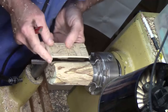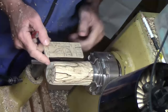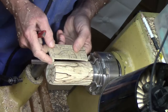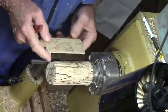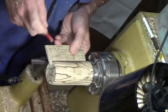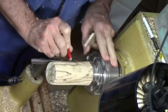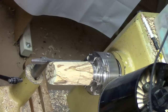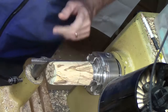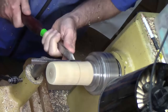Like a lot of my small spindle projects, I make a little storyboard — not that it's really necessary for one project, but it makes it easier if you're doing several. You can use this to make sure the blank is an approximate size. I'm going to first mark off my two and three-quarter inches for where the top of the balloon is going to be, then go ahead and mark that with a parting cut to the outside. That gives my eye something to follow, which I think is important.